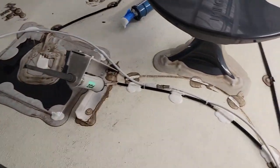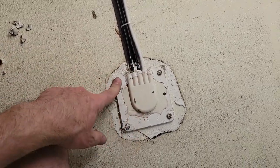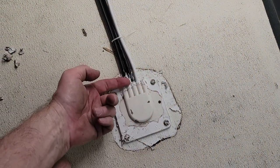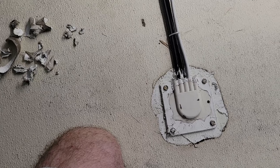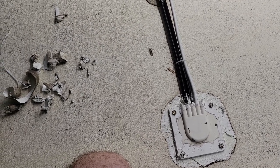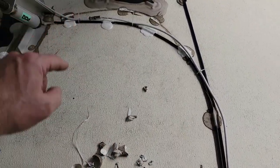The cable is now routed where I want it - I'm going to put all my little blobs of lap caulk at these points. I'm going to re-lap-caulk the whole area, clean it up, and lap caulk all along here to make sure it gets underneath the cable so no water gets underneath. But I'm not doing the lap caulk yet until I get everything up and working, because I want to make sure I don't have any cable problems. Once everything is working, I'll come up and lap caulk it all in place. I still have to take off the air conditioning vent covers to feed the cable from above the microwave down behind the refrigerator all the way to the furnace area.